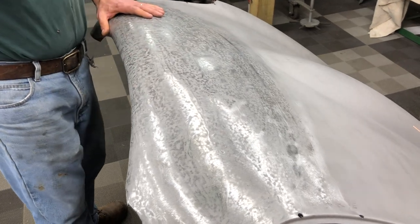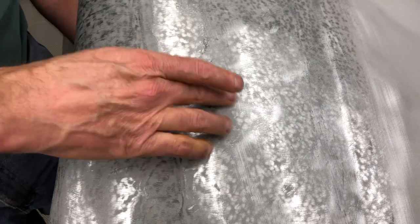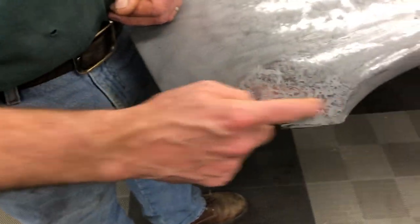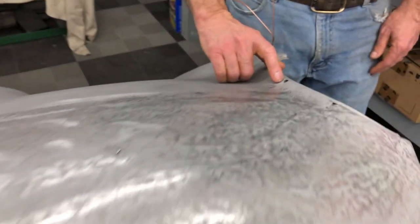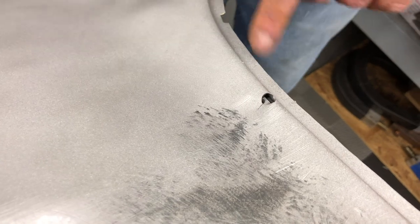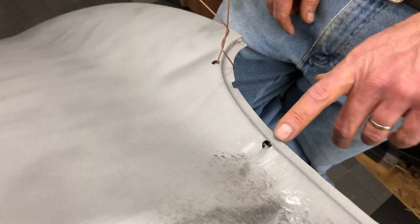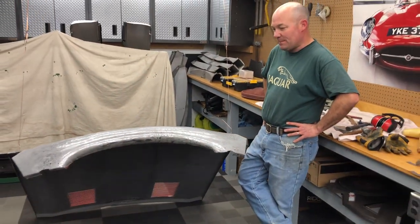For now I need a break. What I'm going to do is weld up this little hole — this is from where it got crushed into the inner valence. We see this all the time. There's a mark here and one up here — this could have been one of those little rectangular speed nut things because sometimes they're welded on and they stick out. Over here, we had those dent puller holes. There's actually a little bit of lead still here, so I'm going to sand that up, weld up these holes, weld this. I'm also not done with this corner. And right here, very common in wrecks, I've got a crack. It might not look like much, but it's really causing me a lot of trouble — I've got a lump here and I can't get everything situated the way I need it. So I've got to go ahead and weld this up now so that this isn't loose.